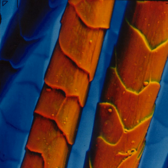In vacuum SEM, the specimen-absorbed current mode is used as an alternative mode for imaging of conductive specimens. Specimen current results from the difference of electron beam current minus the sum of SE and BSE current. However, in the presence of gas and the ensuing ionization, it would be problematic to separate this mode of detection out of the generally operating gaseous detection device. Hence this mode, by its definition, may be considered as unsustainable in the ESEM.